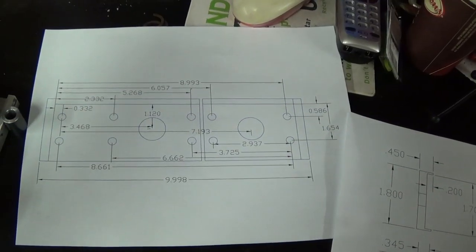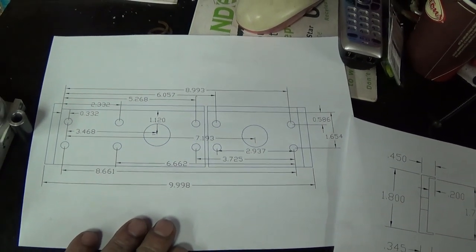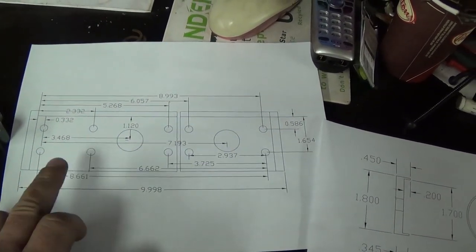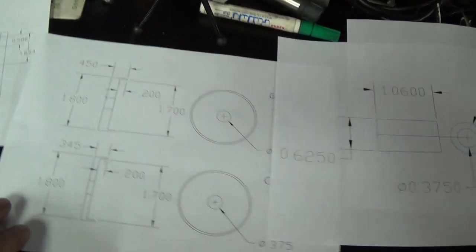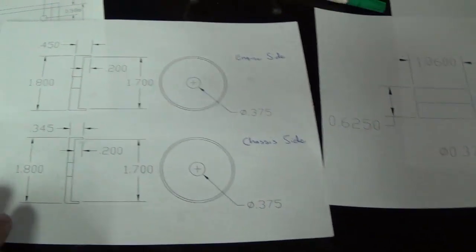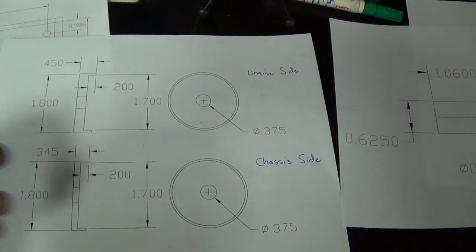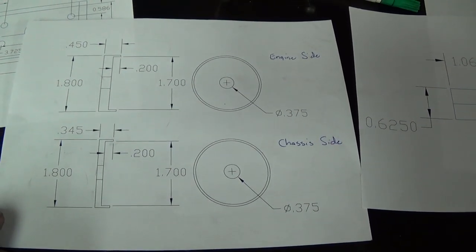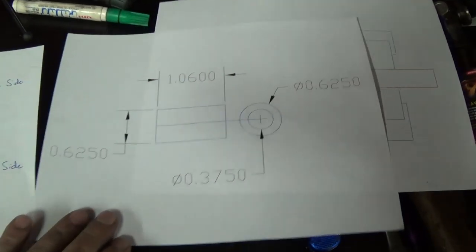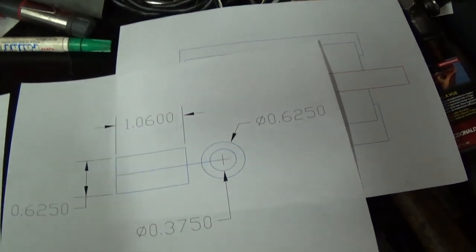So these are the diagrams we're going to use. This one is a set of aluminum plates. We'll do the machining hole layout, then we'll split them in two and face the ends off. We have to make four aluminum pucks to hold our urethane pucks, a couple of different thicknesses, and we have to make some steel spacers. Well, actually, I'm lying. I got those already made.